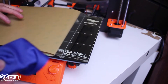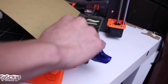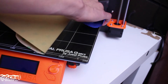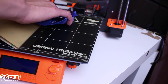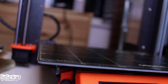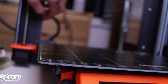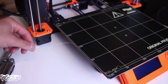I have now touched around 10% of it with the card behind the cloth and slowly applied pressure while peeling the film off. The trick is doing it slowly to get all the bubbles out. Once you have stuck the sheet to the bed, you can see there is a lip that needs to be cut as this can crash into the frame. I have now taken almost all of it off.